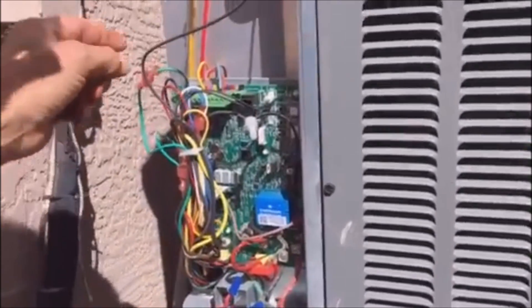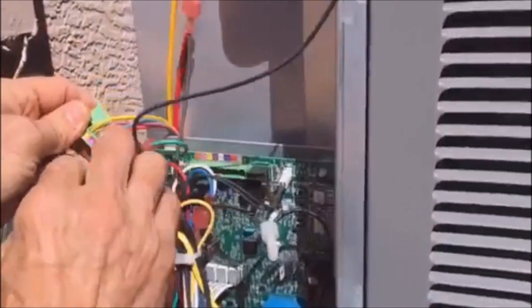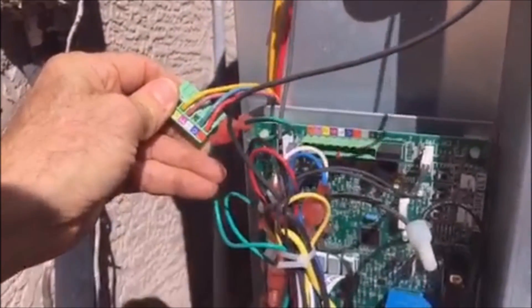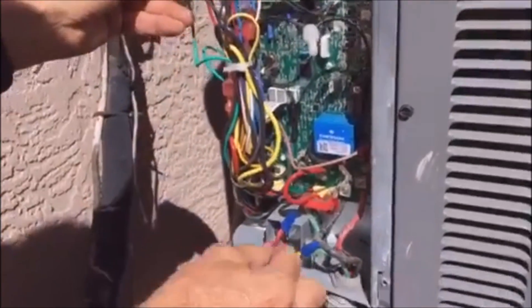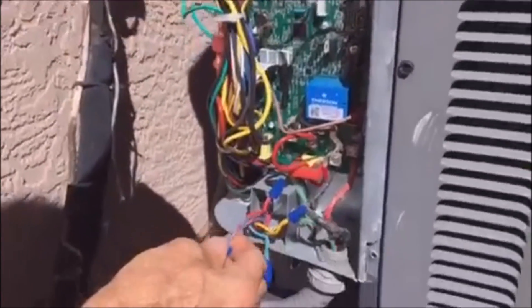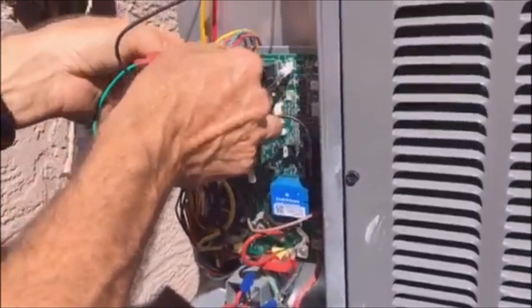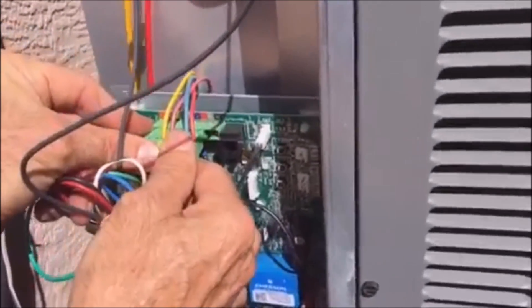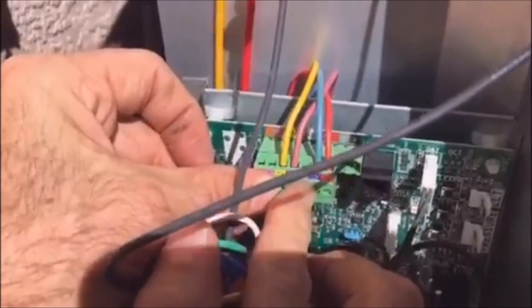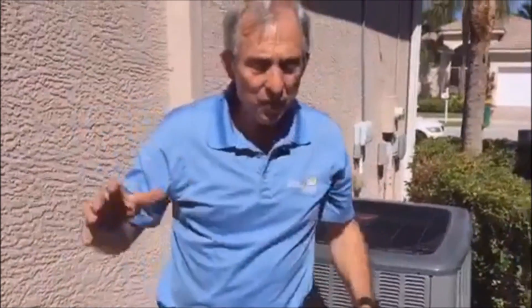Here's the outdoor unit — this particular system is an Amana. I want you to look at these controls. In this particular case they even have a terminal block. Your common is your blue wire — inside they have the green tied to it. Red is hot. They've got Y1 as the purple wire and Y2 as the yellow wire. If you ever need to go snapping, just make sure you line up the R and C — it snaps in very perfectly.